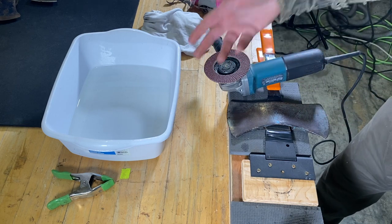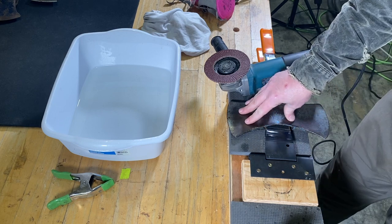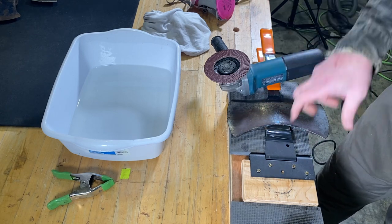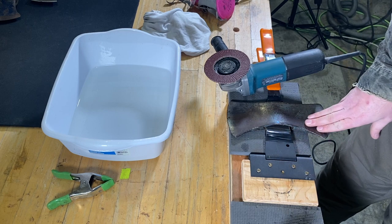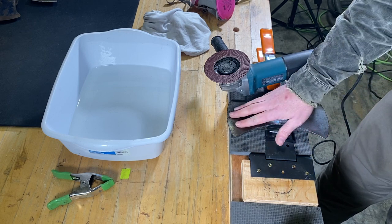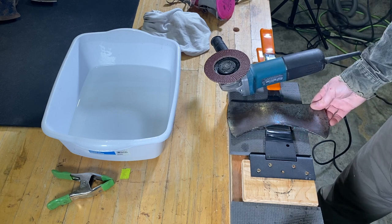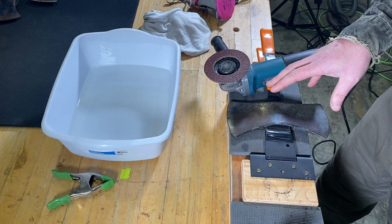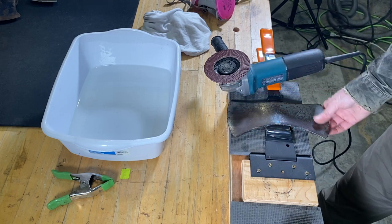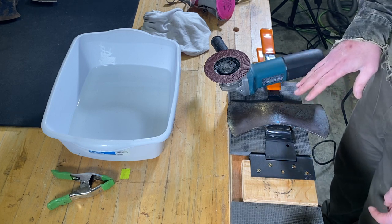You want to be constantly grinding a little bit, put it in, grind a little bit, put it in. Sometimes it's nice to do multiple axes at the same time, if you're polishing them up, and you can grind on one, set it aside, and just start rotating through a few of them is also a nice way of doing it. So last thing you want to do is start getting this thing blue hot or anything like that. So some keys to that is just working quickly, working with the right grit. If you don't have an aggressive enough grit and you go too high, you can start heating the thing up, and you're not taking off a lot of metal, and the heat starts building up real quick. So it's better to go with a coarser grit at first and then work your way up.